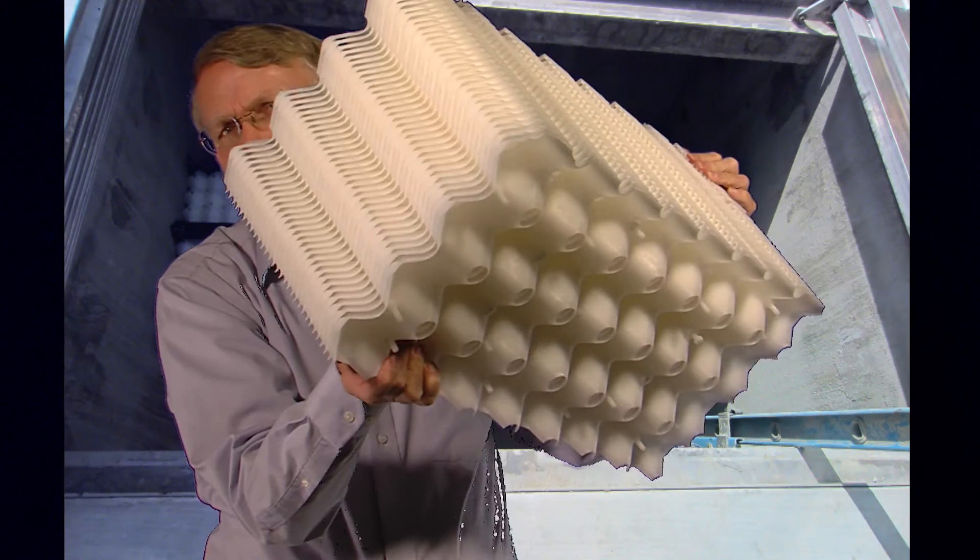If they're really really plugged, you can take the plate modules out — just lift them out one at a time like so — and spray them out above the surface. If you have extremely high solids, you can use the frame type systems, which you can remove the entire frame from the separator, and that makes it easier to service as well.